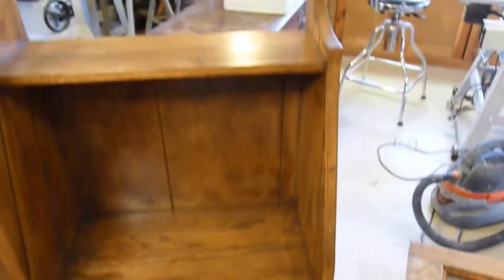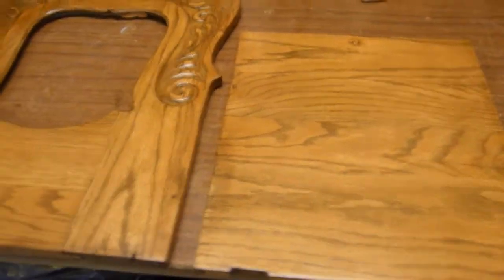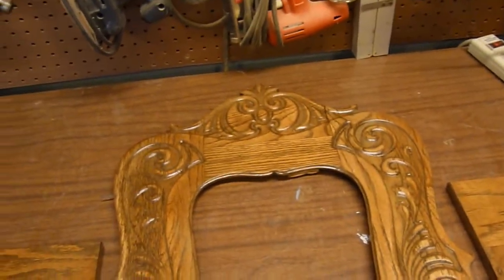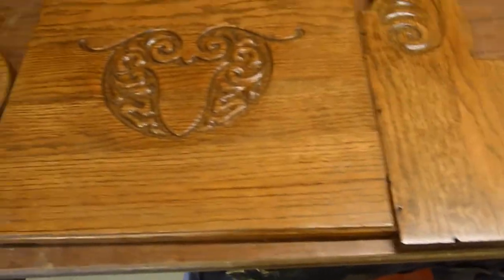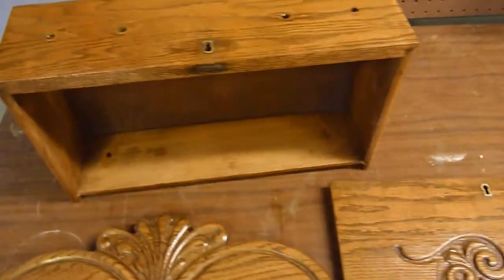She's all ready to go. I did use the satin finish on it — I decided not to try to work the gloss out because it came out too uneven. So the final coat was all polyurethane satin by Minwax. That's the stuff I like to use. We'll be putting it all together here shortly and I'll show you some shots of the completed project.